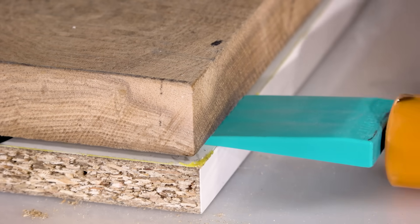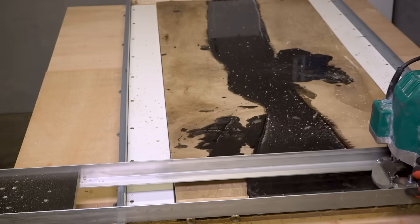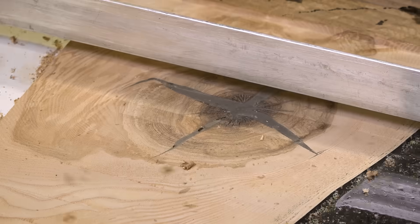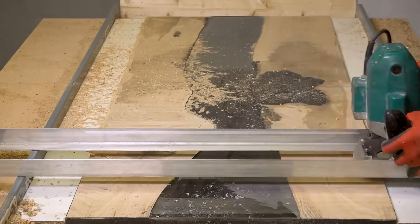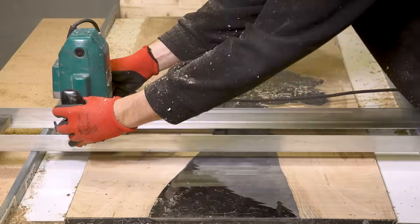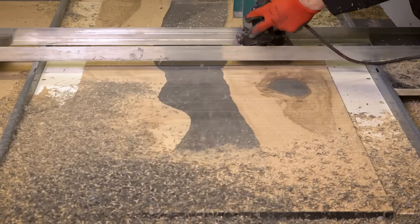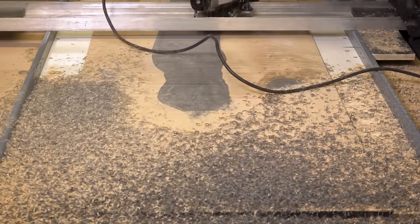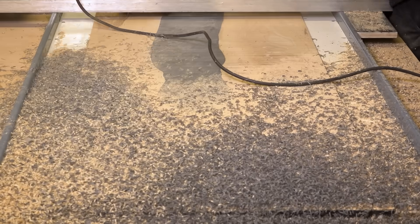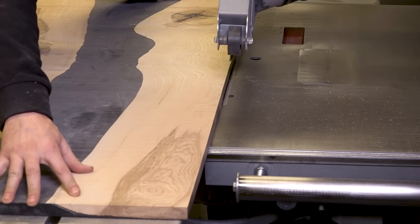The resin comes away very easily from the melamine barriers and base. Machining the surface of the table is the same process you'll see in our original river table tutorial — just using a router sled set up on a flat surface and gradually working your way down, machining through the surface until it's completely flat. Despite clamping them down, I did end up with a bit of twist in my planks, which meant taking a few millimetres off in places to make sure the surface is completely flat. This process is repeated for both sides of the table before using a saw to tidy up the edges.